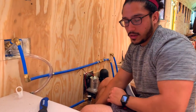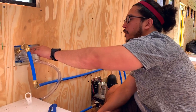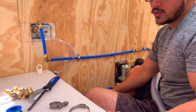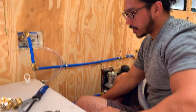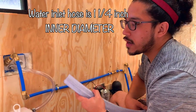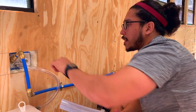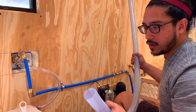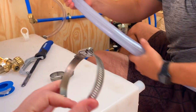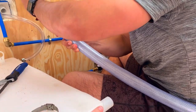Now we're moving on — we're going to install the actual water inlet. The water inlet is going to go to your gravity fill, which is this area right here running downwards, and it's going to go into this top piece right here. We're going to use a one and a quarter inch inner diameter piece — we got a five-foot piece from Amazon. It's the same system as the air hose using these clamps, and we're going to try to get it at a downward slant.